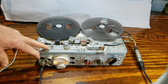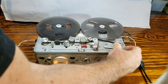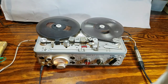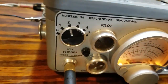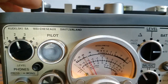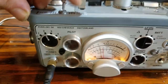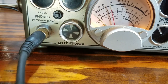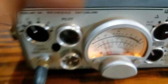I'll test rewind. By going into rewind, we'll see that the rewind action is really positive and spunky. And then we'll go back into play. The fast forward switch, as you can see from the accelerated reels, is working well. We can observe the motor current on the motor in play — you see where that meter is reflecting at minus 15, that's just showing relative motor current. But when I go to fast forward, we'll watch it bounce, because now the motor's drawn a lot more current at high speed. And then once you take it out of fast forward and it locks up again, the tachometer is showing that it's back to speed. When you bump the speed with your finger, you'll see that the speed meter shows we're off speed, and then we go back to level.